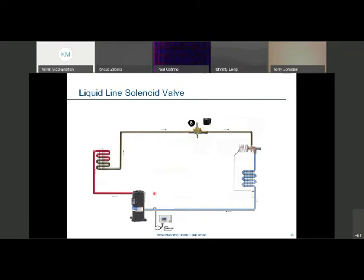That's the pump-down cycle. What it's good for is that refrigerant on the low side has an affinity for oil - in the off cycle it migrates to the oil and condenses, diluting the oil and causing bearing failures inside the compressor. So we get as much refrigerant away from the oil as possible and store it on the high side. Air conditioning is different - no solenoid valve, you simply energize the Y circuit which turns the compressor on.